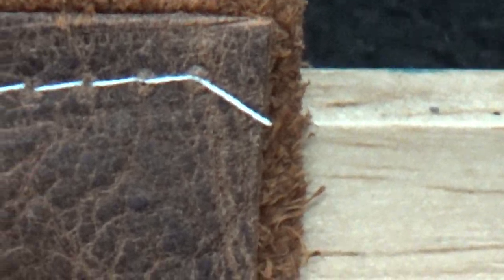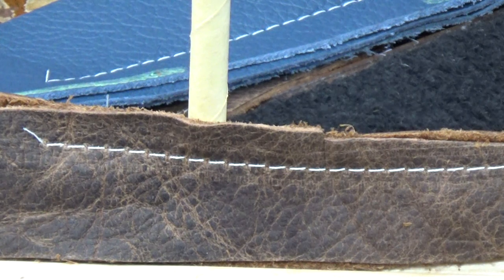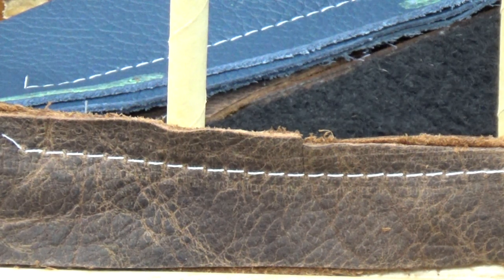So I'm still at a page 34 with the stitching, but we would make a slight adjustment in backing off that upper tension slightly so that we get the full length of that stitch, the full length of that lock stitch. Beautiful stitching nonetheless, beautiful stitching. So there's the totality of the stitching. Again, if this were on a product, the presentation of the stitch, the beauty of the stitch is just exactly what we want to be seeing.